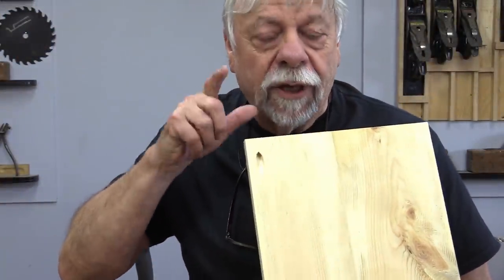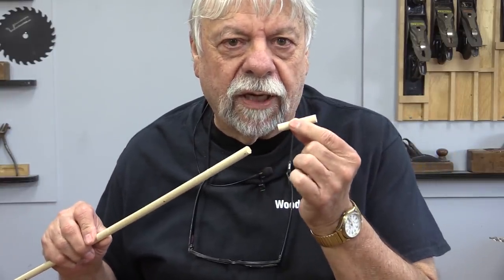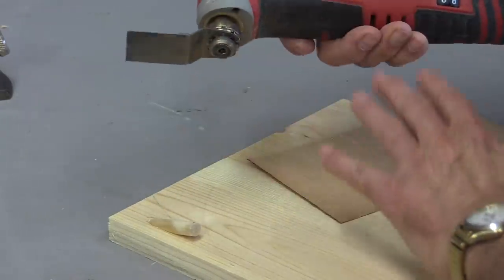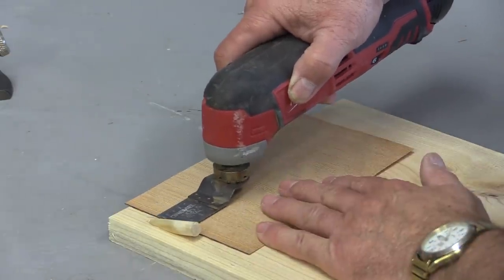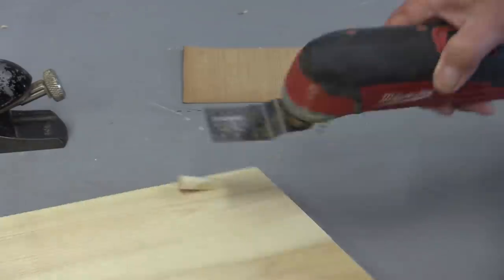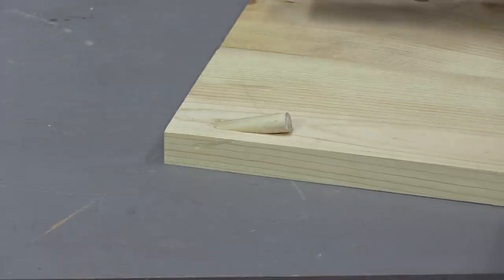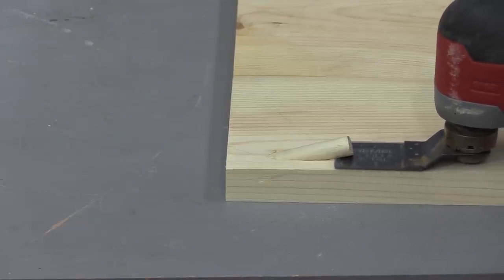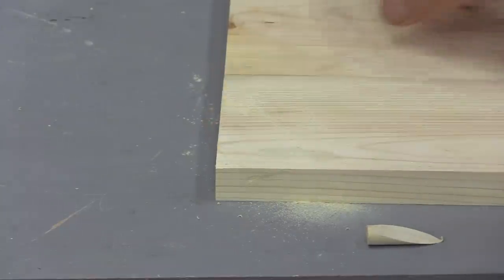For all of you out there using pocket holes, here's a great tip for filling those pocket holes. Many of you already use long dowels and cut them off into pieces, but here's a trick from Bob. Bob says to cut those dowels after you've got them glued in there using your multi-tool. Depending on the job, you could use a thin piece of veneer to raise it up a little bit, then use a hand plane or sand it down. You could come in from underneath, from the backside, or from the sides — whatever works best. A little bit of sandpaper and that would be just perfect.